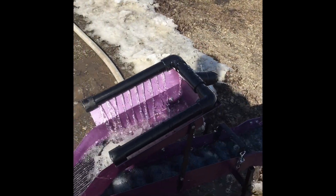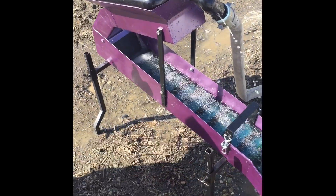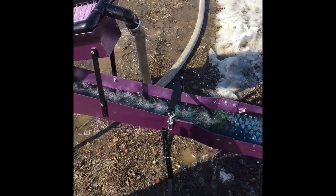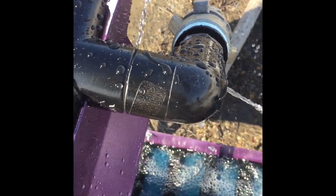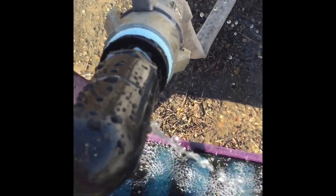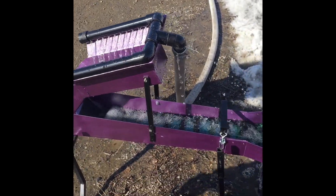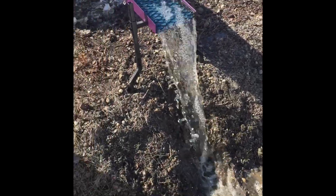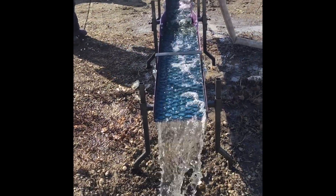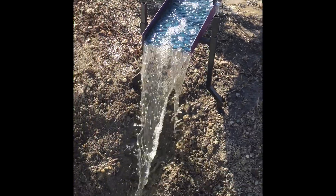Holy, that's a lot of water — look at that! Dad, there's holes in it. Yeah, there's supposed to be holes in it. Is that water coming from here? Yeah there sure is. We gotta put some sealant on those PVC joints — that'll take care of those little sprays. I just hand-tightened them, I didn't know how much they would spray out. Yeah, that looks pretty cool. I'm trying to set about a 6-degree slope right now.